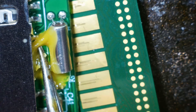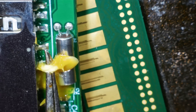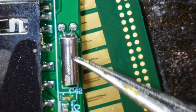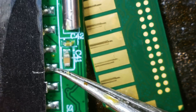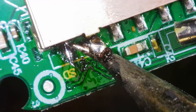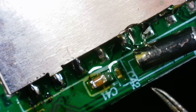There are nine points that I'm going to have to solder wires from. I'm going to use 0.1mm enameled wire, and that should work — it won't short out because it's enameled, so it doesn't matter how careless I am with the wire placement. Before I do that, I do have to remove some funky glue stuff that's sort of holding down this crystal. And once that's out of the way, I can get cracking with the wiring.